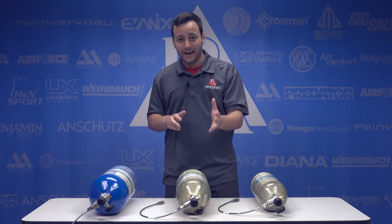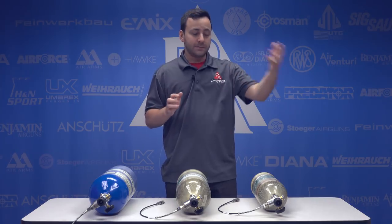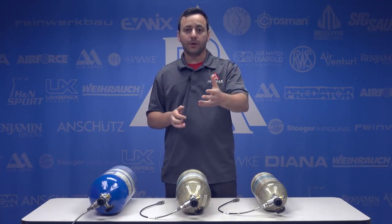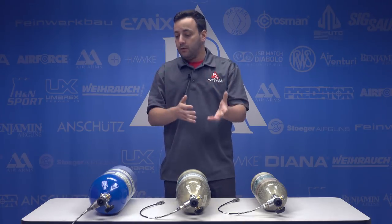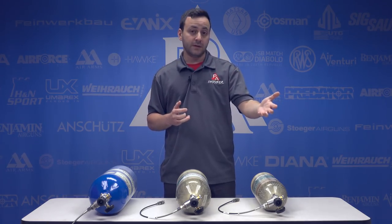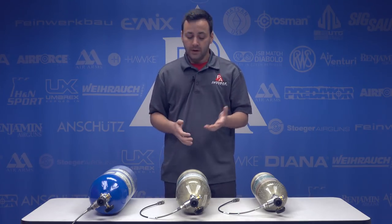What we're here to talk about today is life extended tanks. A standard carbon fiber tank once it comes out of the factory has 15 years of lifespan in the U.S. For DOT regulation purposes, those tanks are good for 15 years — so if it was made in 2015, it'll be good until 2030. What about tanks that can last longer than that? What if I told you you could get a tank for 30 years, or a tank previously owned for that initial 15 years and then extended to go to 30 years?